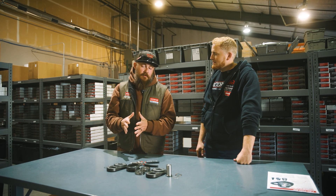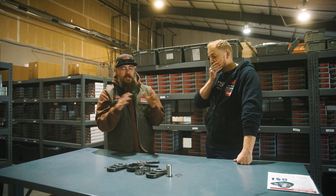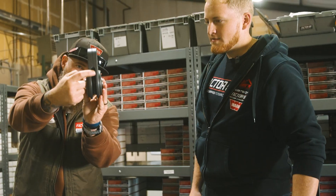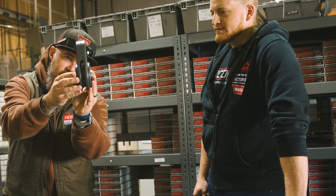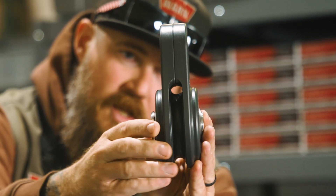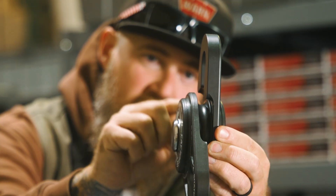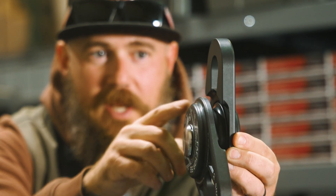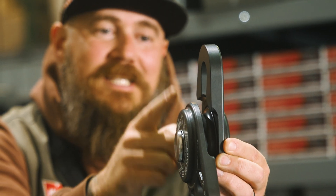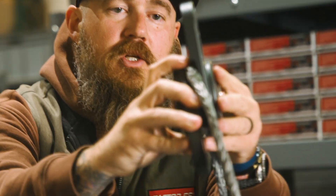Let's break it down and talk about a couple of interesting features that are going to separate this from any other SnatchBlock that's readily available. If you get really tight in there, you can see where the sheave is sitting in the middle, and because of the machined sheave and the hard anodized coating on it, when this opens, you can see where the sheave sits against the plate wall. That means the rope — whether you're using steel cable or synthetic rope — can't jump the sheave. There's no way that it can jump out of there.